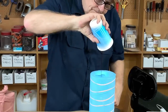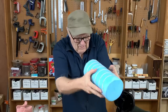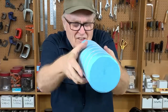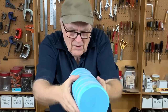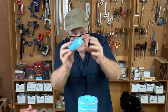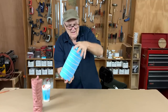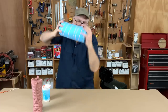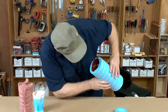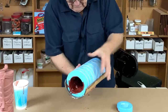Just dump it in there. I will simply rotate it by hand. Because I have a big opening at the bottom, I can see what I'm doing and watch the resin as it flows around inside the chamber. I try not to spill it — I might spill it, I've got paper underneath me. So now I just take a plug, a leftover chunk of rubber from a previous job where I mixed up too much — that's the advantage of keeping this stuff around. I'm just going to hold it on there and slush it. I just want this to gel up enough. It's gelled up enough, I believe — let's put this into a cradle momentarily.